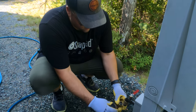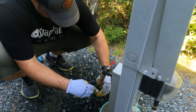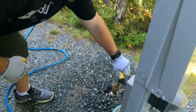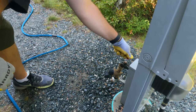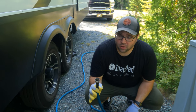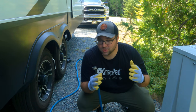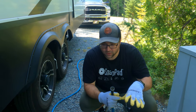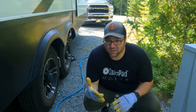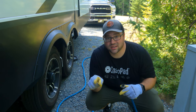Let's go ahead and get that on and test the water again. The first stage is hooking up our water softener. Usually on travel days the salt and everything in there is swishing all around, so we get this hooked up first and then run water through it for about 30 seconds. Normally the water comes out pretty dirty looking, so I want it to be clear before hooking it up to the next part of the system.